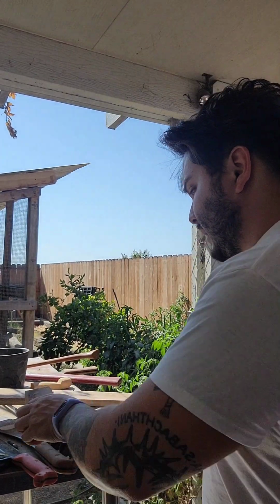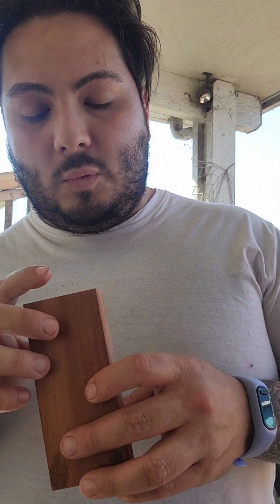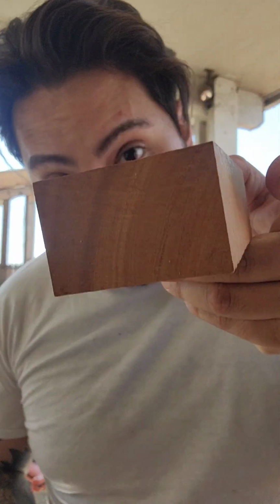That's the one thing about using locally sourced materials, that you want to be nice and eco-friendly, but at the end of the day, eco-friendly often looks like cheeks. I got all this wood from a local place, Urban Timber. I always shout them out, some of San Diego, and they have a great selection of wood, especially because it's local. They work with people who need trees removed and stuff like that. But the main issue is that whenever these woods are drying, like sycamore, they start cracking, and you're left with a pile of nice square machined table-sawed pieces of wood that you need to throw in the fire pit, and I don't really like that.